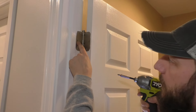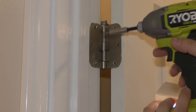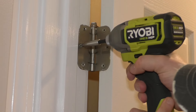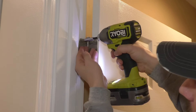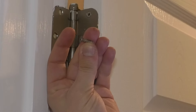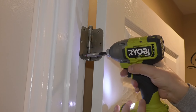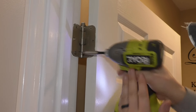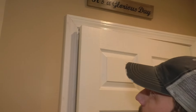Let me give you an example. I always put my long screw right here in the middle because this screw hole is a little further this way and I have a better chance of getting into that framing back there. I'm going to take this one out and see how long it is compared to what they come with — which are probably three-quarter inch. I'll put this back in loose to simulate years of not having a long screw in here. If you look on the inside, what can happen is over time your door starts to sag, and that's when you get the rubbing and the door sticking shut.